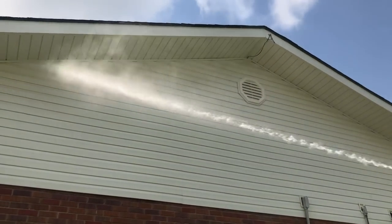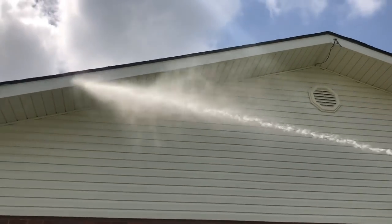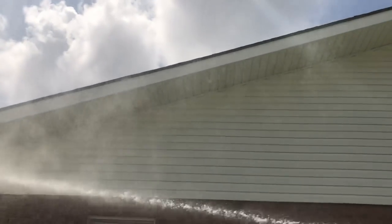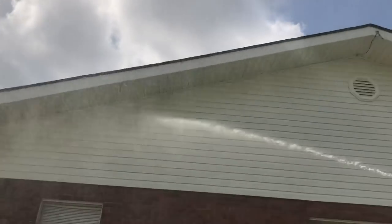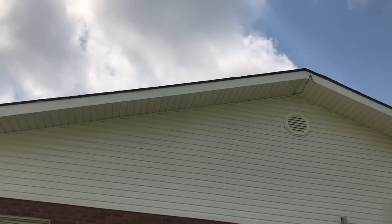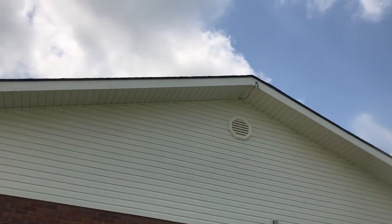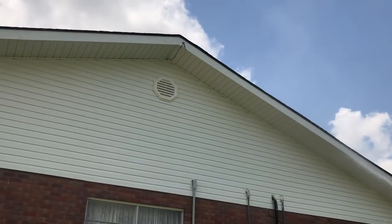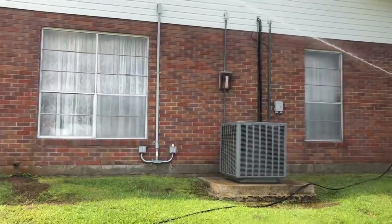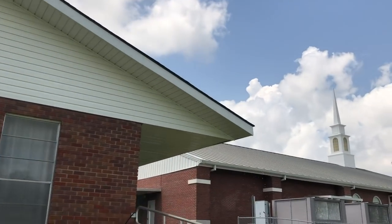Like our name says, Davidson Pressure Wash and Painting, but it's really no longer a pressure wash. Back in the old days, yes, we had to use pressure. Now, with the inventions of the high flow machines, the phenomenal downstream injectors and soft wash systems, it's no more of a pressure wash. So if anybody ever asks you about that, you can tell them that's the terminology we use, power wash, pressure wash, but actually it's neither of those, other than a little pressure on the sidewalks or on a brick. Other than that, everything is almost like a shower head.